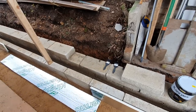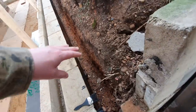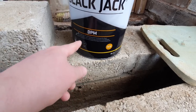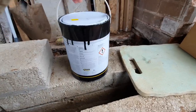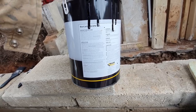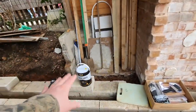This is the retaining wall that we've been building, as per the request from building control - this wasn't on the plan but the building controller asked us to do it. He also wanted me to tank it somehow, so we've painted all the back of it as you can see with this stuff which was recommended. This is a DPM and it's suitable for waterproofing walls, above-ground structures and foundations. It does also say on the spec sheet that it's suitable as a damp proof course for foundations below ground. It's a liquid DPM, so three coats of that should be fine.